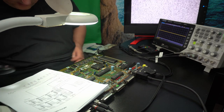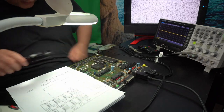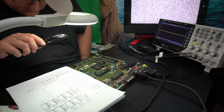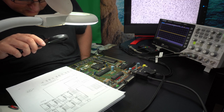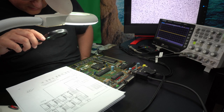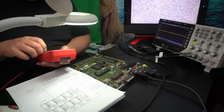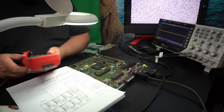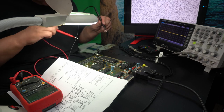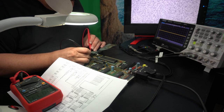So the supply pins are given here at the bottom of the diagram. Okay, that's interesting. This is a 20 pin chip, and the plus is on 10 and ground is on 20. Not really following TTL logic. So volts. Let's see. Yes, to remember that ground is 20. All the weird things on here. 20.